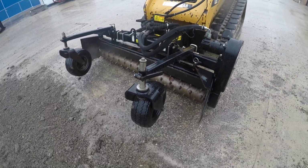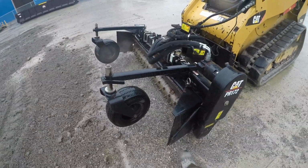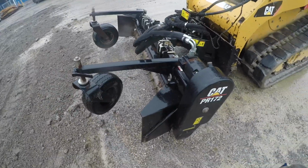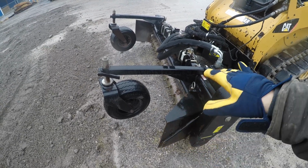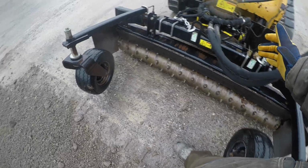Instead of raking by hand this big area, we use this thing. It works really well. So it's raining pretty good right now. So you're gonna get the Cliff Notes version of Harley raking here. We'll do another video sometime, really breaking down and explaining these things. But basically, it's kind of a similar concept to like a motor grader. You've got the wheels that are gonna sit on the ground, and then obviously the skid, and you're grading out over 2 planes, so it levels out a lot nicer and does just a really good job. What it does is this drum spins and kicks up all the rocks, and we'll end up just basically piling them up in a pile and probably scooping them up or seeing if we can bury it.